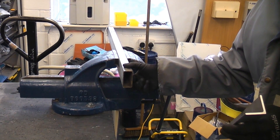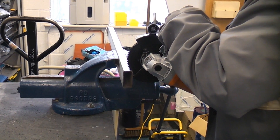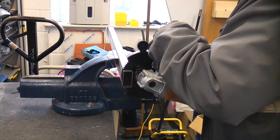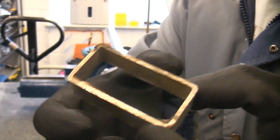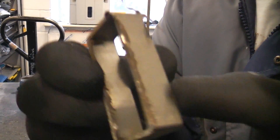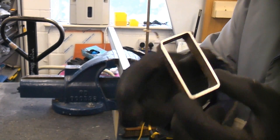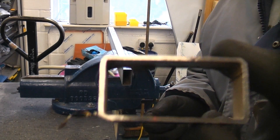This is 316 stainless steel — it's very tough and very difficult to cut. You can see that it's cut through that very cleanly indeed. We do have a slight burr there but that's nothing. If you look at that side, that is the side that was cut with the steel saw — you can see it has burnt it and put massive burrs on that side. But on this side we've got a relatively clean cut with minimal burrs. So it is very good at cutting stainless steel. I'm not entirely sure how long the blade would last if you were constantly cutting stainless steel, but it does work and it works rather well.